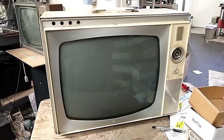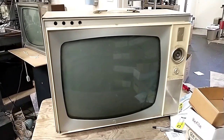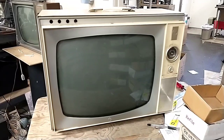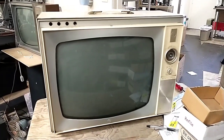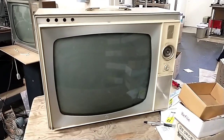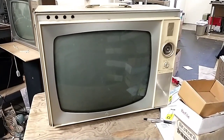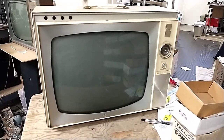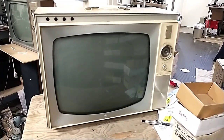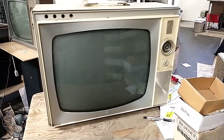Welcome to part 3 of a '63 RCA black and white TV, KCS147a chassis. If you've been watching the previous videos, we replaced the majority of the tubes, which I tested all badly. And then in the last video, we discovered that the horizontal hold control, which was a 70K potentiometer, according to the service literature that Shanko found me. Thank you for that. So, bad 70K pot. We're probably not going to find a 70K. I have 50Ks, I have 100Ks, so we're going to make something work and see if that potentiometer replacement gives us a stable picture.